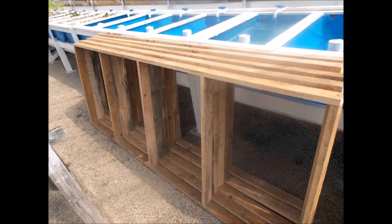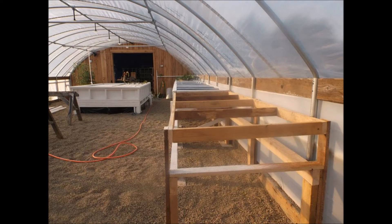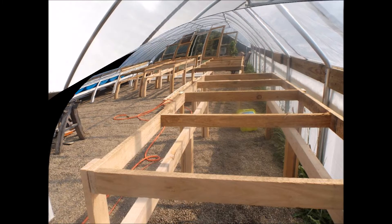After selecting your stock and cutting to size you assemble the top frame that holds the half barrels together. Here you can see I'm doing this in mass setup. You then assemble the leg framework. The horizontal support for the barrel is at a different height between the front and the rear — remember this when inserting the barrel halves into the framework. Attach the legs to the upper framework, then attach a spreader between the front and the rear legs, as you can see here in the foreground.